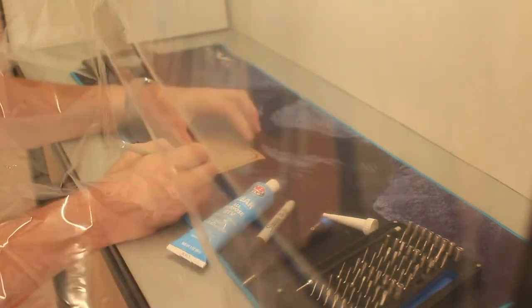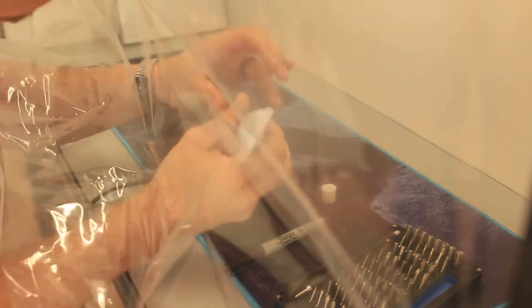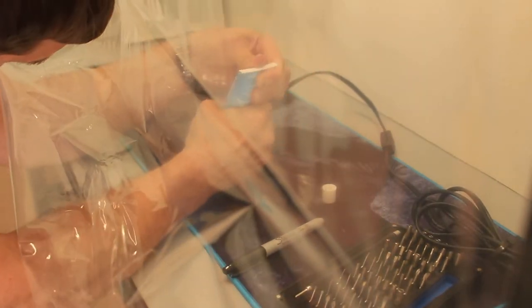What am I doing with the cardboard? I'm creating a gasket that I'm going to seal with silicone, and it's going to seal up the gap so that no other dust can get in. It's like a cheap picture frame that happens to hate dust. I'm using the silicone to seal the fan to the gasket — it doesn't have to be airtight, we just want to make sure that dirt and dust are not getting in. I'm attaching the fan to the filter using screws penetrating the silicone into the filter itself.